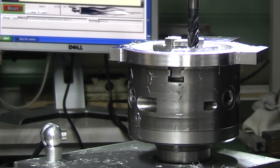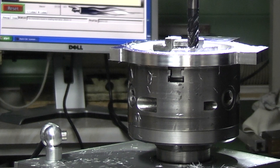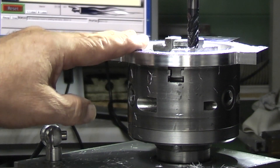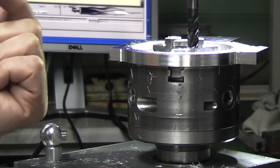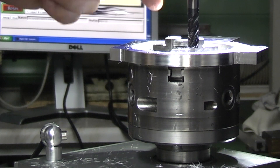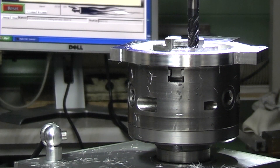What I have to do now is - all I'm using is the A axis on the CNC. You've got XYZ and then you go on to rotary axis ABC. I've wired this up as the A axis. So although I've got my computer on in the background, the CNC is on but it's not running - all I'm using is the one axis to control the stepper motor in this head. This will be ideal with the spindle lock. If you're doing a dividing plate, you're just coming down, you're not fighting the chuck as it's moving. So the backlash problem wouldn't be there - you would just drive it one way, lock it, drill. You might not even need to lock it because going down you're not pushing the chuck either way. But it's getting there. I've got an idea for putting a spindle lock on there, so I don't think there's too much of a problem.